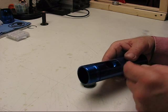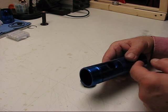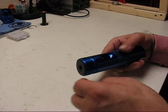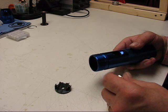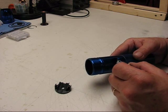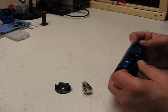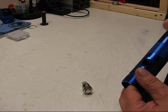in this way, and it will have the contact for the positive terminal of the batteries, and the wire will come out. I'll have to solder right there. The other one won't really matter because I will just run the wire right out through the hole on the other side going up to the emitter. So basically the one side is all I got to worry about, and that means only one wire I got to mess with. So I can solder here and just stuff it down in, tighten the nut up on the inside, and then once the switch is tight, then I can put the wires through the hole on the other section and put it all back together.